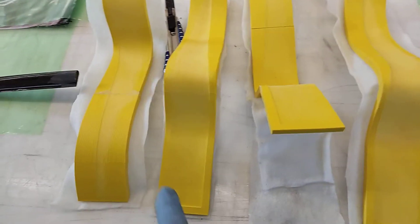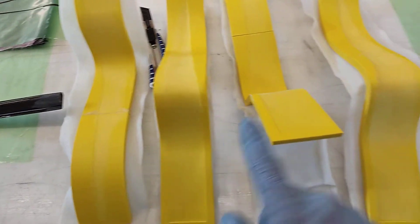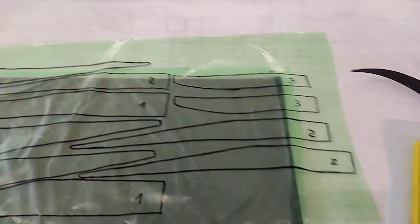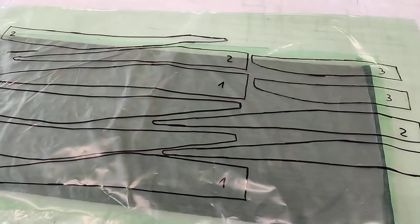I have then made the second mold and decided to build two sets of foils at the same time with the same resin and the same curing temperature. This gives me probably the best result — two foils which are completely identical. The layup for this second foil set will consist of layers in 45 degrees.